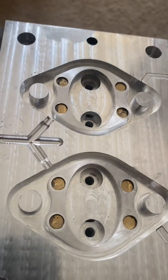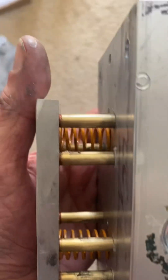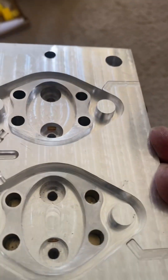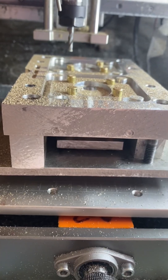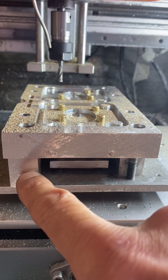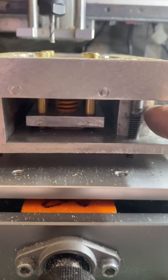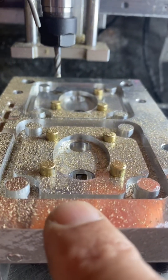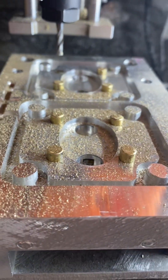Then you set the height that the mold will run at and mill them flush. The symbol there has the spring in it. It fits into a jig I use for milling — the jig uses the same thickness spacer bars that I use in the injection molding machine, screwed to a plate, which pushes my pins up to the right height to clip them off at.